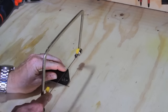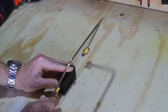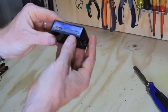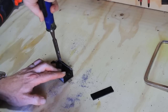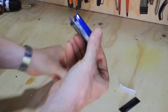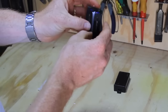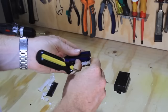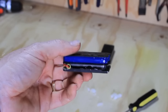So let's pull one of these apart. These are actually Chinese fakes - they are not actual EMG-81s, so I don't feel that bad about cutting them apart. But it is made to mimic what the original 81s are. Now the pickup case has been sealed in epoxy resin, so I'll start by cutting that out. The first thing you can see now is that inside they're entirely wax encapsulated. Now this wax potting is really to keep feedback away, and it also seals everything so it doesn't vibrate in sympathy to the string. Now I'll remove the last of the case. This exposes the two bobbins and shows that they're a rail type pickup. You can see that it's a single blade style bobbin in both cases, simply to make sure that there's consistency the whole way across the pickup face.